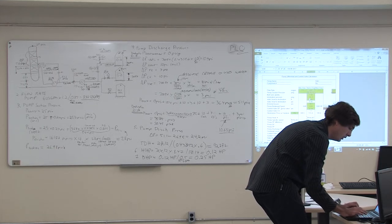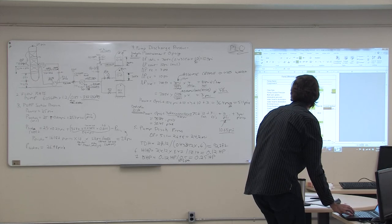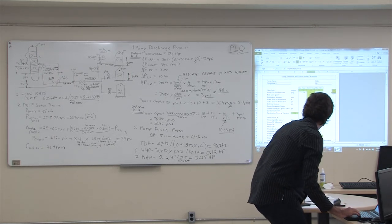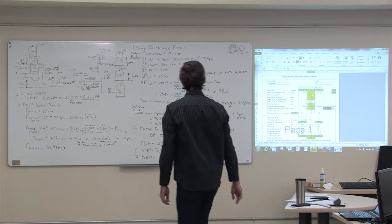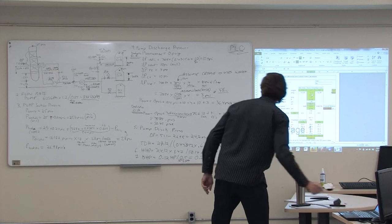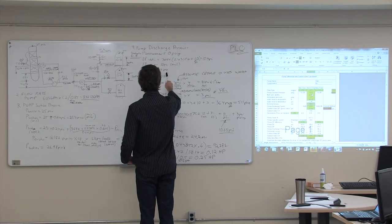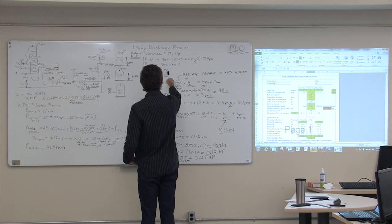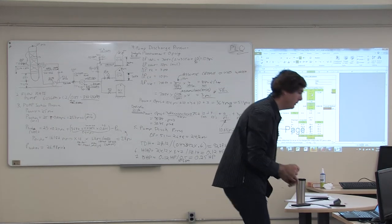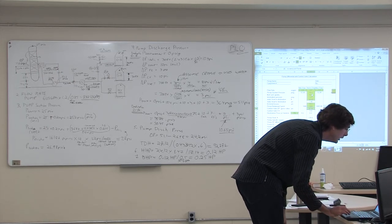Connell's method says we should have about 15 psi across the control valve. Currently converged with a max-to-minimum CV ratio of 4 — we want to make that 10, so we do a goal seek: change the control valve DP to achieve a CV ratio of 10. The result is about 18–19 psi across the control valve.